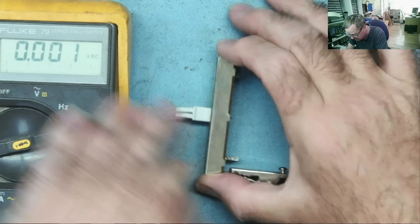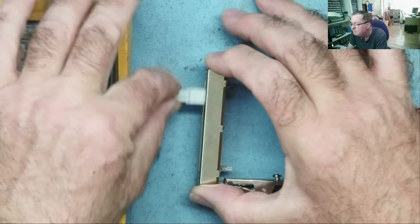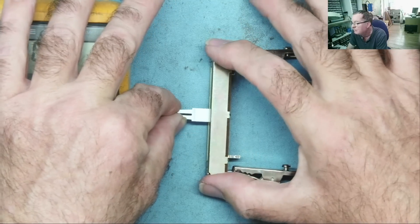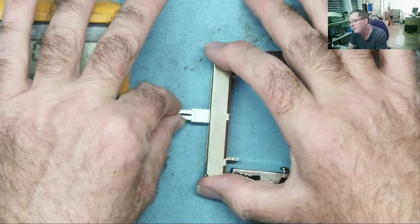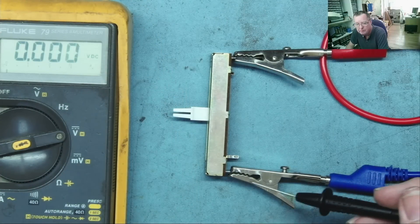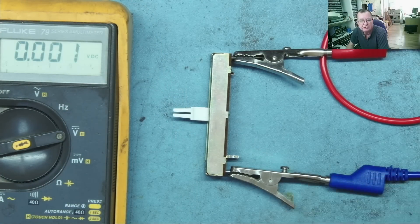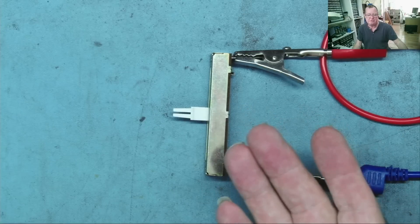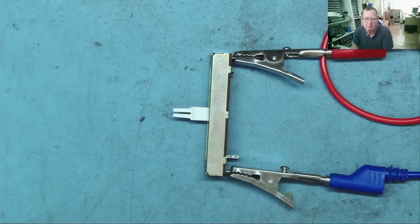As expected. I'm going to set the slider to the middle — you can see it lines up with this mark here, so we can say it's centered. The question is: what is the voltage between the end and the slider with the slider set in the middle? I'll allow a little bit of tolerance in the answer, because the supply isn't exactly 10 volts and we can't be sure it's exactly in the center — but ballpark, what's the voltage on the slider measuring from here? That's question three.